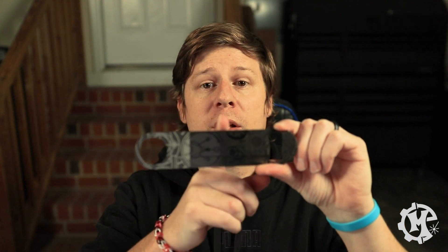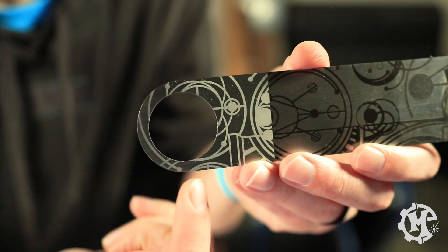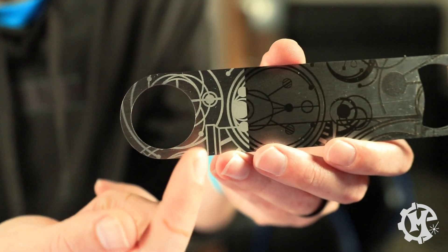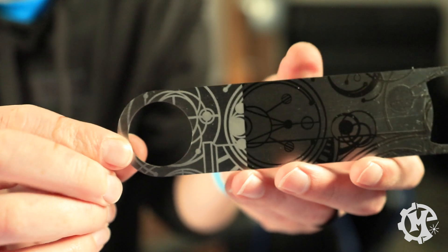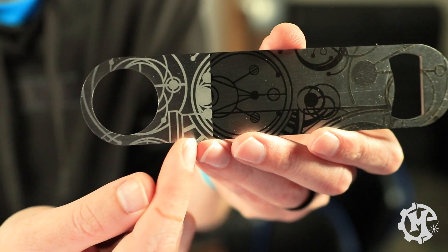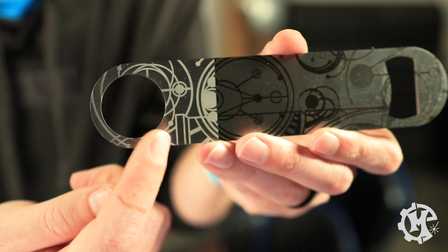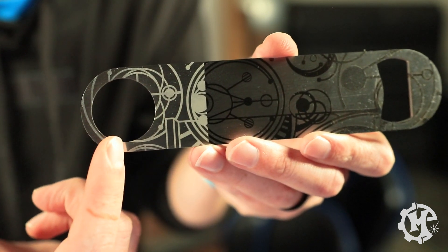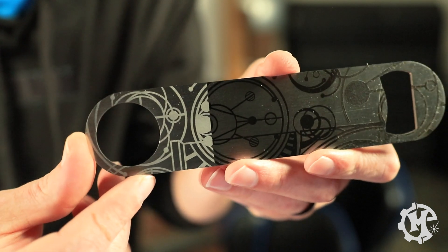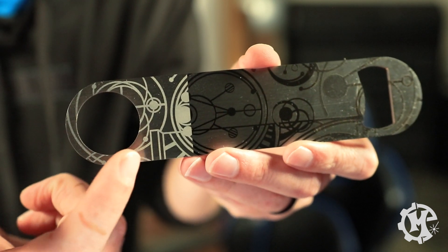Here's the bottle opener. On the left is polish, the middle is anneal, and the right side is the etch. The metal polish is very bright — it has a white contrast versus the stainless steel and it really pops. I've actually used this polish process underneath UV printing to give a holographic type feel and look, and I really like how that turns out. It's also a very quick process.